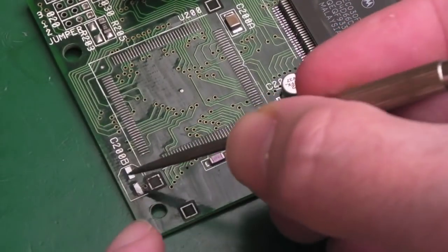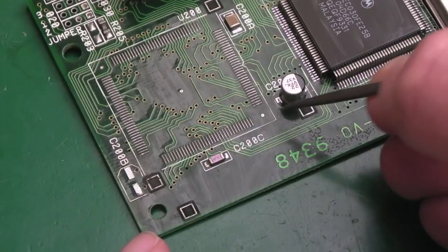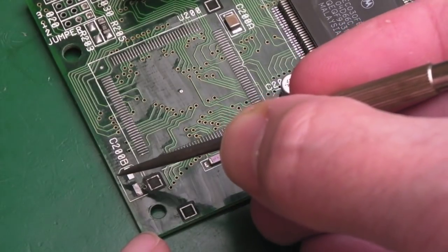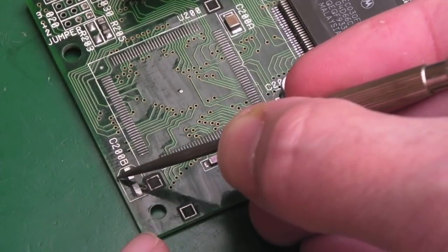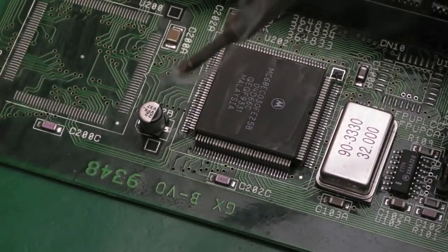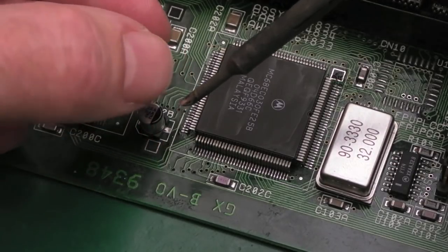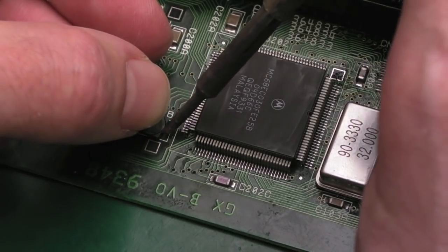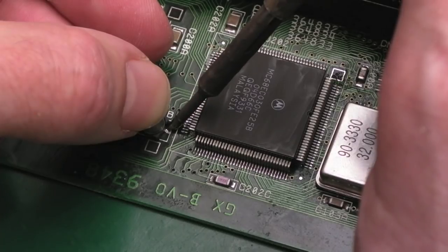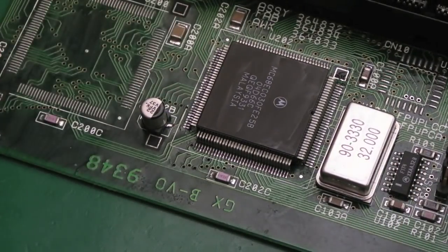And as I've shown before, there's a silhouette around it. Can you see it's angled here? And the component has got a little angled piece on the plastic, black part there. So you put the angled part here, so you can't really go wrong. You really do need to use magnification just to make sure you've got it aligned properly, and then before you solder, just make sure you can see what you're actually doing and it's in the right position. Anyway, that's one side on.